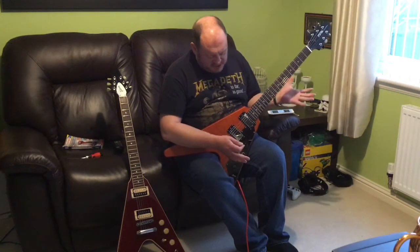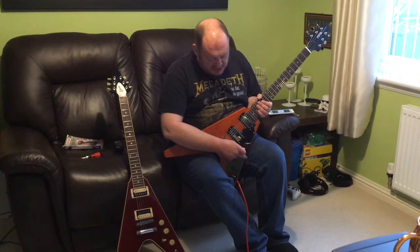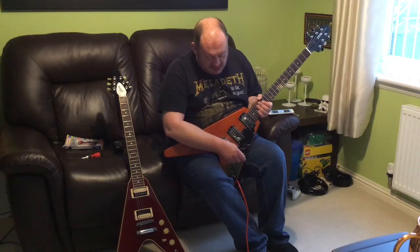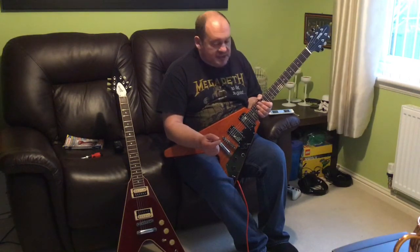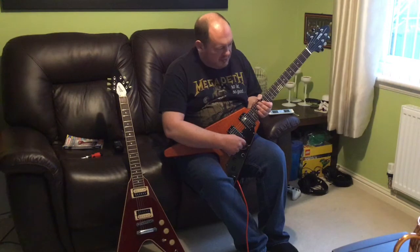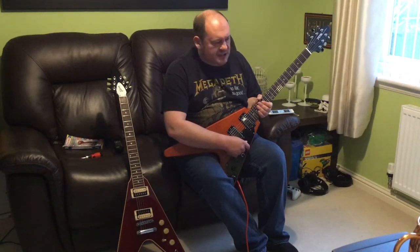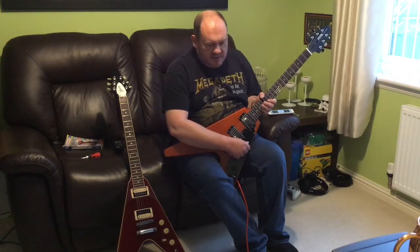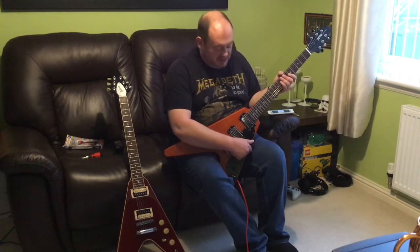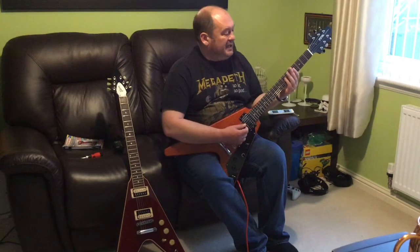As I said through the video, this is pretty much as it comes. I've not replaced the pickups yet. I did replace the pots, the full size pots, and a new switch because it was broken, and I put treble bleed circuits into the two volumes. It's just basically a resistor and a capacitor wired in parallel, and they go across lug 1 and lug 2 off your volume pots. You don't put it on your tone pot, obviously. It goes in your volume pots, and it basically retains your tone as you turn down. We'll try this pickup. You can hear it in a tap, it is pretty microphonic, so we might get some squealing like a pig, but...